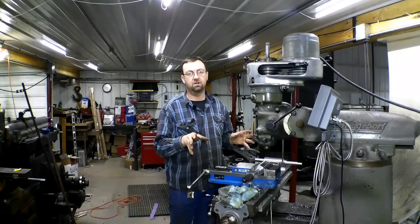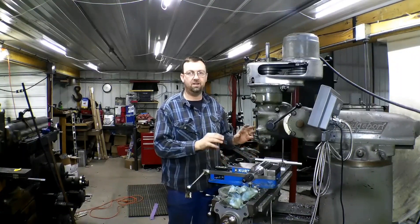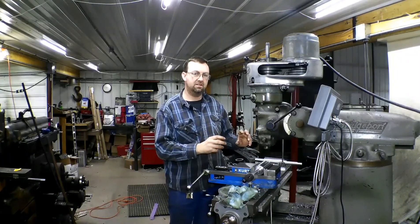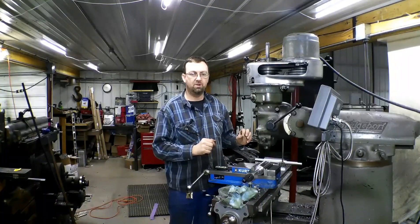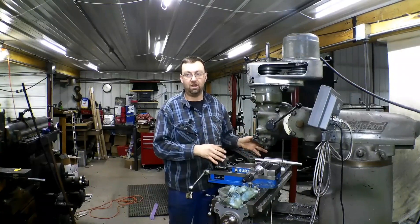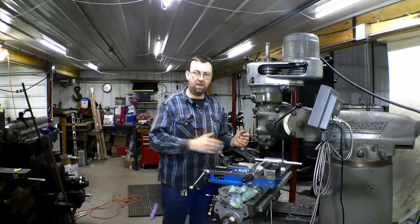Or a rotary positioner if you want to do that. This particular shaft gets balanced afterwards, so these features aren't absolutely 100 percent necessary to be completely perfect, but they get so close to perfect that the customers have never had an issue with it. They actually haven't even been balancing these shafts when they put them in, which is kind of cool. So let me move the camera in.